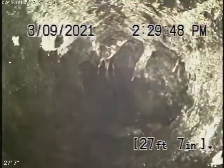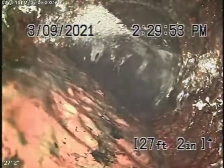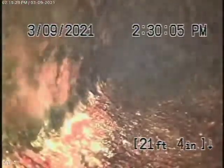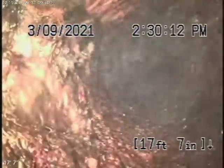We're definitely going to recommend that a two-way clean-out be installed on the outside of the house. You can see these very thick roots right over here. Then it comes to cast-iron pipe — it's getting a little old. You can see it does have a little bit of rust build-up. So I'm going to recommend a two-way clean-out be installed outside, run a cable with a blade to descale this pipe somewhat, and also run a HydroJet downstream. Then you'll be able to complete this inspection.